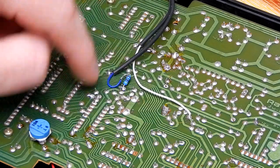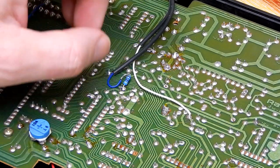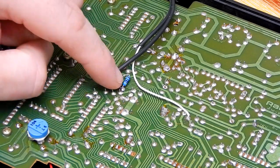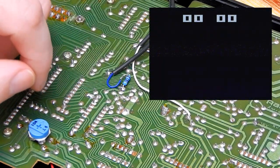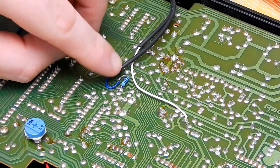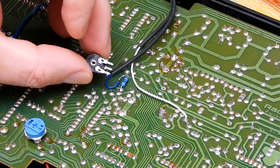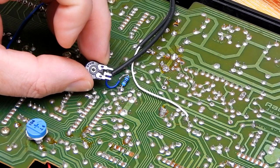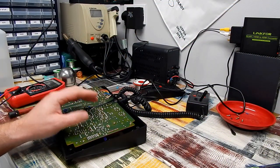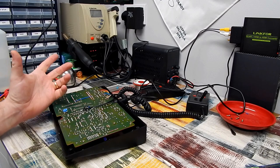This is the composite mod we did last time, following a mod by the Nightfall Crew — I'll link it in the description. They used a 22k trim pot but last time I didn't have one, so I used a 4.7k resistor instead. While we did get a video signal, it was a bit rough. The middle leg of the trim pot gets connected at that point, ground goes into one leg, and the output comes from the other. Now with the genuine PSU connected, let's see what happens.